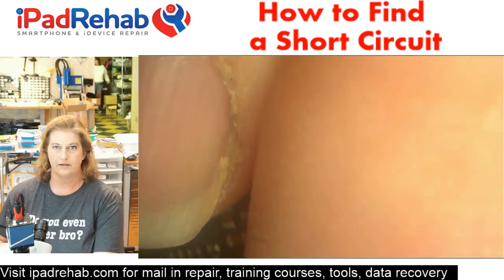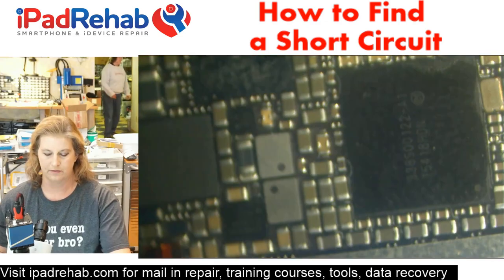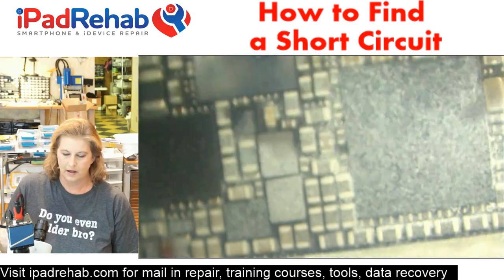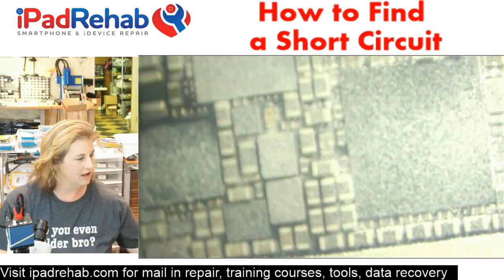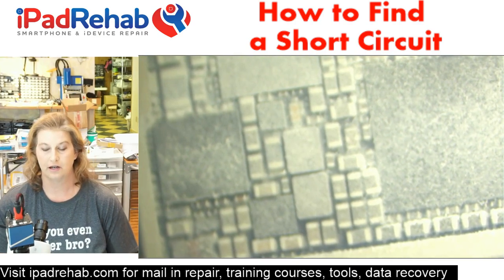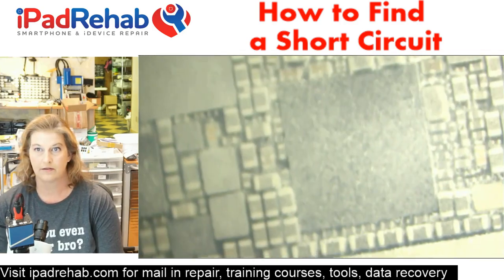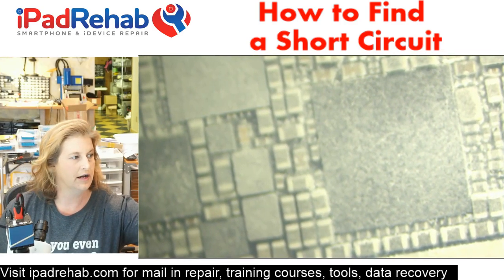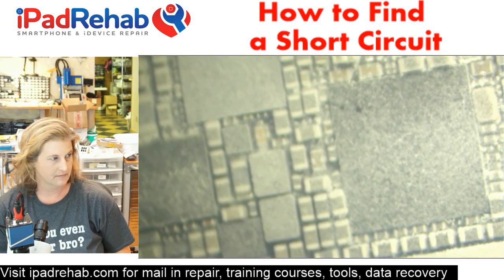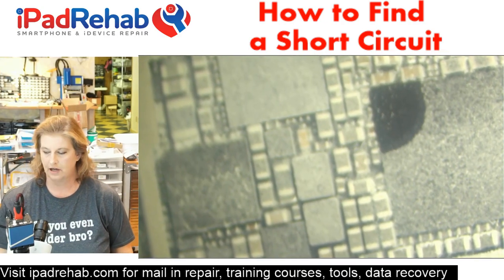Frozen tundra time, yes. I want to be judicious with freeze spray. I know it's a stress to the board, so I want to wait for the board to be about room temperature, and it is. So let's spray it down and have a little festive holiday snowfall on the board. See, check it out. All right, Sharon, watch this. See if you can tell me now where the short is. Ready? All right, here comes some current. Oh, wow, that's quick. All right, so we'll turn that off.